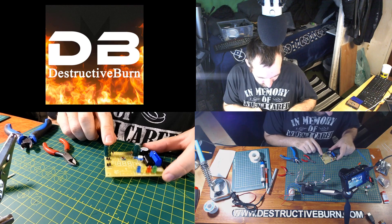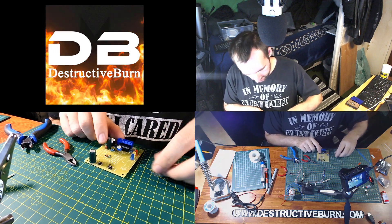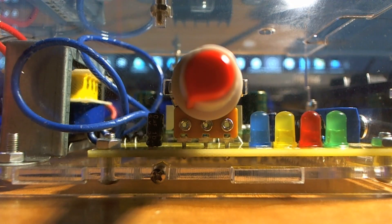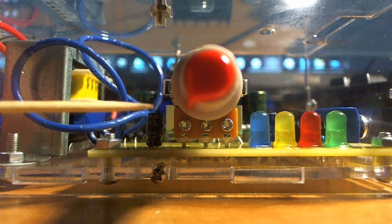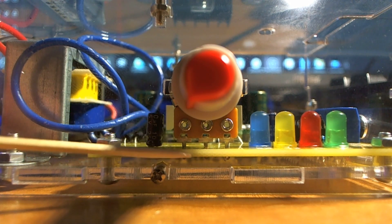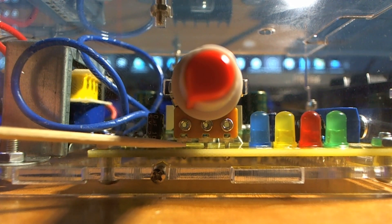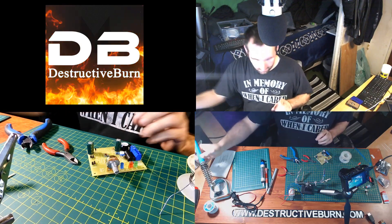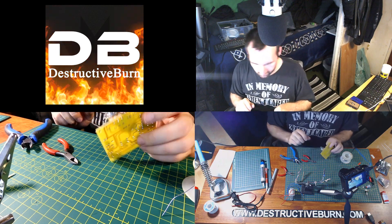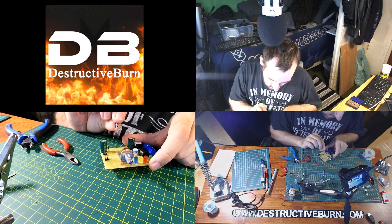The next component is the potentiometer — make sure it's facing outward from the board. Future self note: don't let the potentiometer sit completely flat against the board, because when you put the front casing on you may need to do adjustments with the solder. Just leave a little bit of a gap. I'm not going to cut off the leads right now. Since we now have something to protect one of the capacitors, we'll put the next piece in.